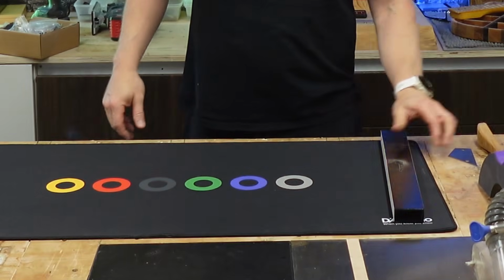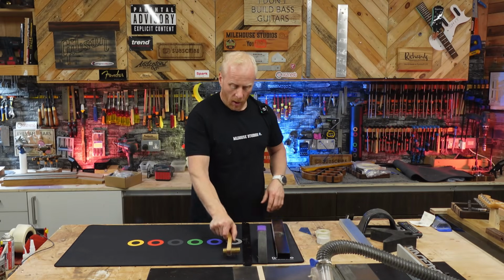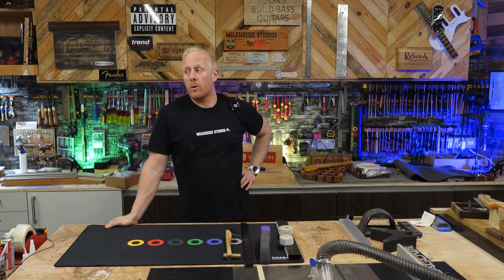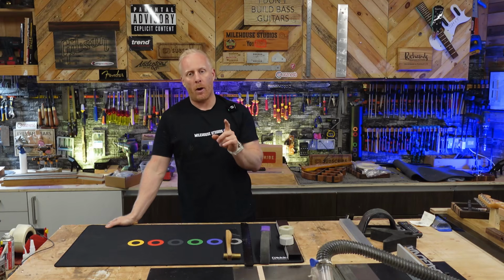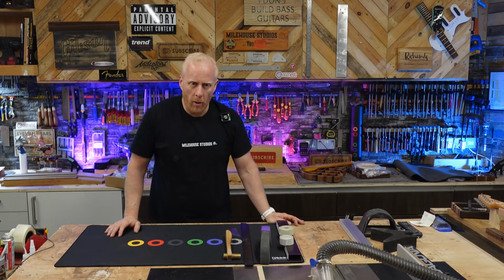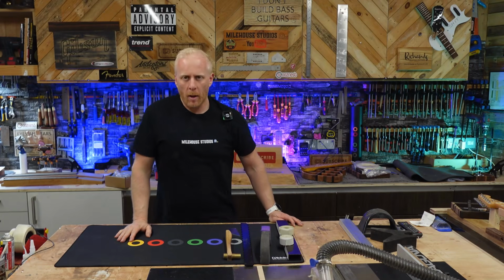Right, so we've got leveling beams, we've got neck supports, notched straight edges, we've got a brass hammer, we've got a cheeky rocker. If you're using your leveling beam, you will need to recrown your frets. Now this is a point of contention. A recrowning file, if you buy a cheap one, will be no good. Definitely it won't touch stainless steel. If you're going to buy a recrowning file, because you're going to be doing full fret jobs, you have to buy a good one.